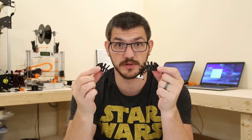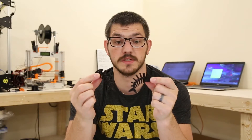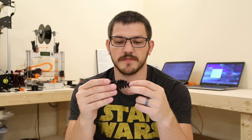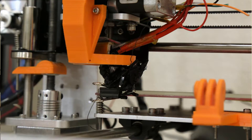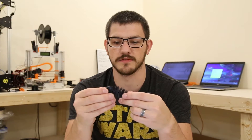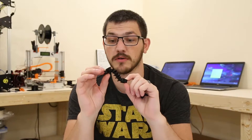Now we have the black. I had enough to print three fossil fish since you can get three out of the 10 meters. The first one came out perfectly. The second one did not — after about five or ten layers it caught and grabbed everything. I walked away after the first two layers and it had completely gummed up my extruder nozzle and heat block. I got it cleaned off; not sure if it was the filament's fault. But that was the only failure of all of these, and both fossil fish that completed came out great — same settings, nothing changed.